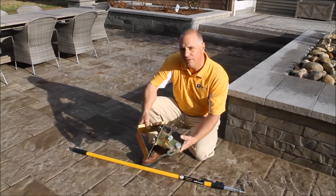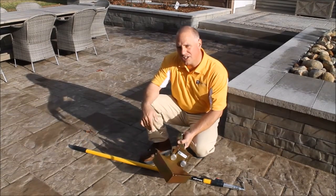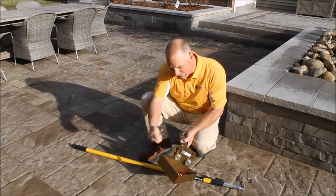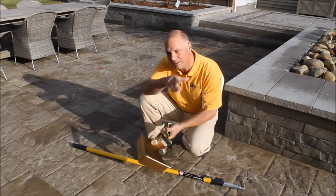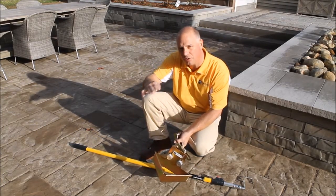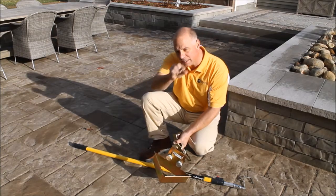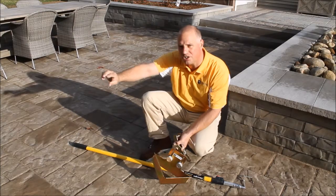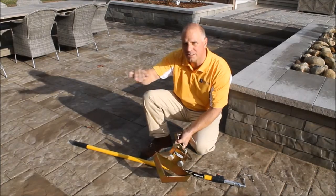The Quickie Sand Plow is a tool created for kicking sand away from your edge before installing your edging. Improperly installed edge restraint is the number two reason for job failures in our industry. Guys use a trowel or shovel to pull sand away along the entire edge, and what happens is you get rutting or dipping from pulling away that sand. You put in a rigid edging, and now you've got little void spaces underneath. Over time that sand migrates out from underneath your edge paver and you get dipping and settling along that edge.